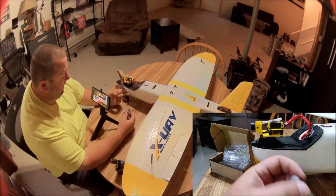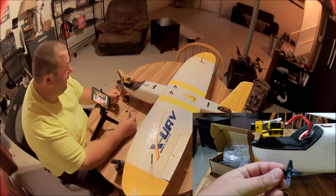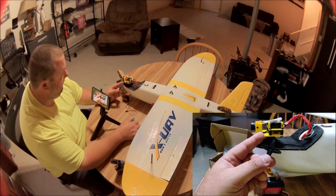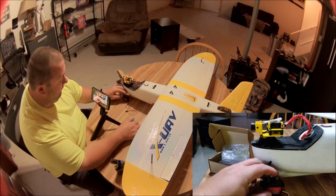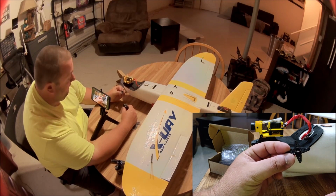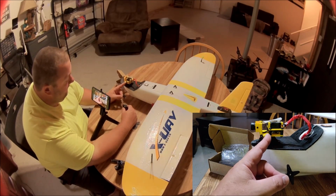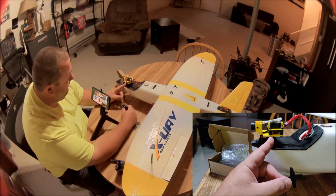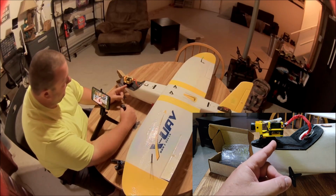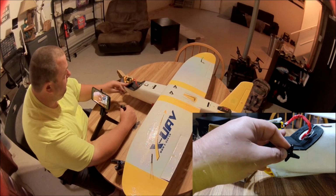But it did come with that, but I didn't use that. I used the plastic ones. So I used this one, and I'd say this would be the weakest point between the PETG being tough, which you saw the video of me trying to destroy that, and this servo being rock solid. I would say this piece of nylon here might be the weak point, but still, I don't anticipate breaking this. If I'm breaking this servo and I'm breaking this pan tilt setup, I have done massive damage to the plane. It is not going to be a weak point. It is not going to fail anytime soon.